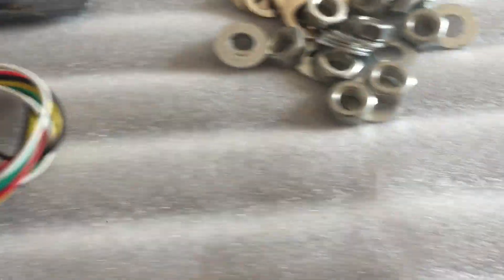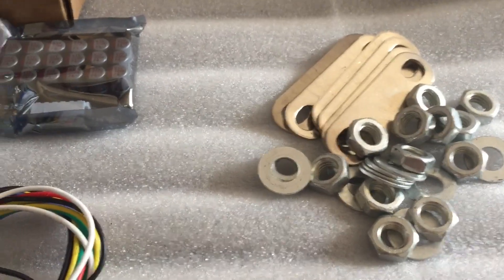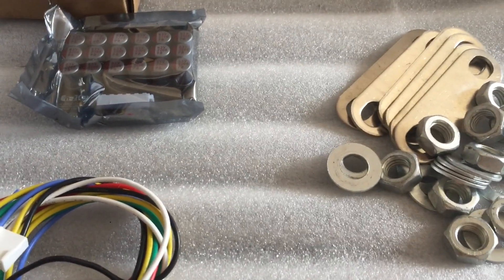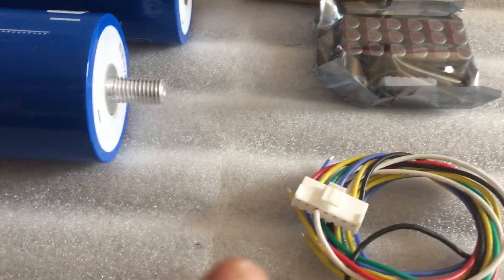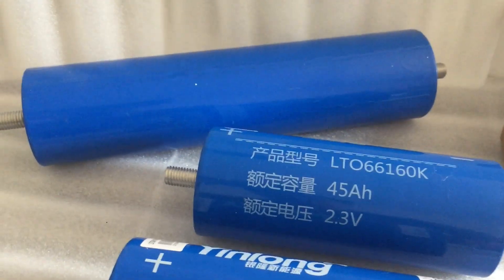The balancers are very easy to fit and you get the link bars with it, so you really don't need to buy anything. All you need is about two to two-and-a-half inch of copper bar — like what I've done there — to link the ends of the positive and negative when you get that to a 12-volt setup.